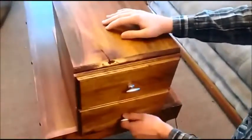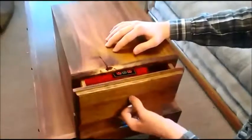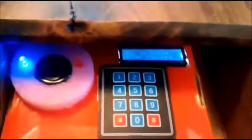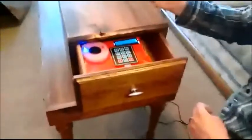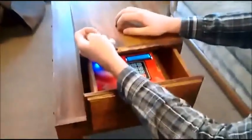As you can see the bottom drawer is locked — we can't open it up. Come up here to the top drawer. Right now the LCD screen says that the box is locked and it wants us to enter in a password. That is going to be the secret knock, and once we enter that correctly the solenoid down below will open up and unlock the box. So first let's see what happens when we do an incorrect knock.